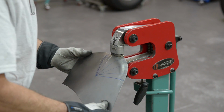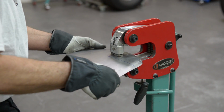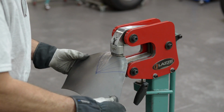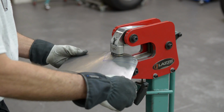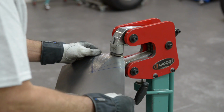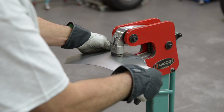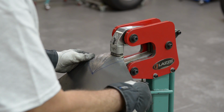And then I do two high pressure there, and then less pressure the further in I go. Whatever you're going to do with the shrinker and the stretcher, be consistent with your shrinking and your stretching. The smoother the surface you get, the less job you need to do when you go over to the English wheel to smooth it out.